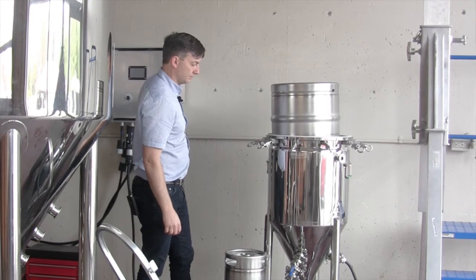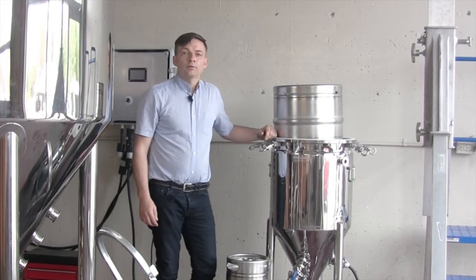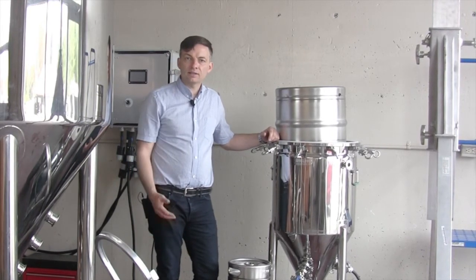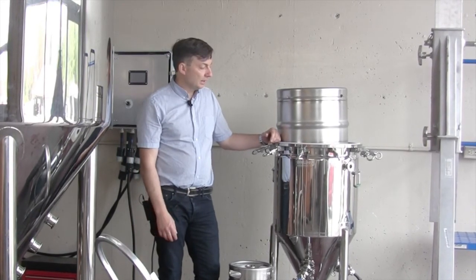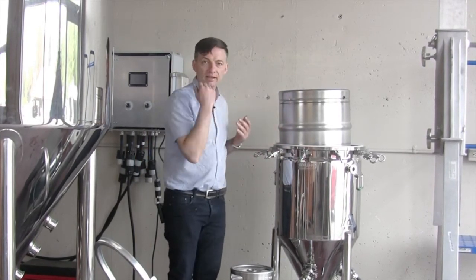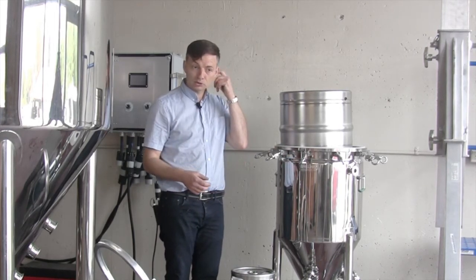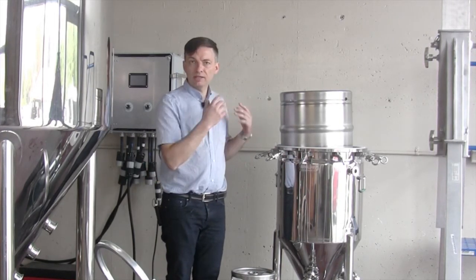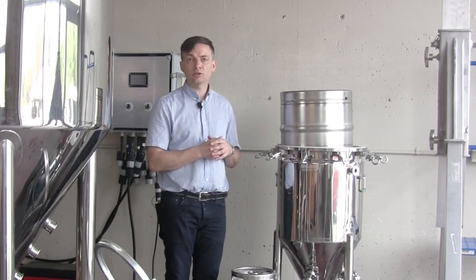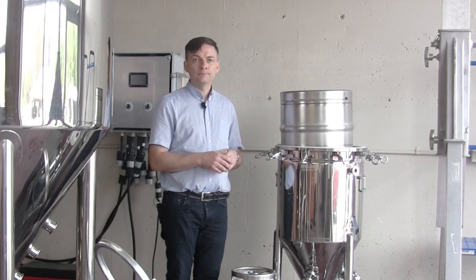For commercial breweries or brew pubs, you're going to probably have 20 or 30 kegs on a given day that you might want to clean. The best thing to do is pull the spears on them, rinse them all out, and just drain that to the drain. Use your water pressure from the tap, your municipal supply, just to flush out any of the beer that's sitting in there. If the kegs are basically clean going in there to start with, then you won't need to change the water very frequently, if at all.